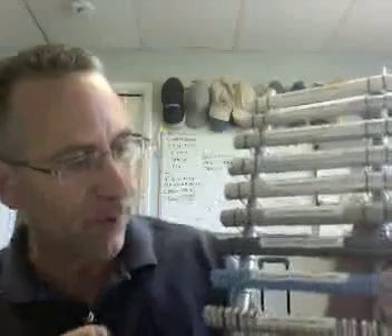A little trick that electricians use to identify whether something is aluminum or steel is to simply use a magnet. This small square magnet sticks to the steel flexible metal conduit but will not stick to aluminum. You can test the same way with rigid conduit — the magnet will not stick to rigid aluminum conduit, but it does stick to the rigid steel conduit.